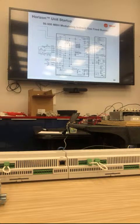Honestly, if you look on the right-hand side, not the contacts or the poles of the relay, but actually the board. If you put a jumper between W1 and W2, that will cause the inducer to come on anytime you have heat 1 on. Another thing I want to mention is that we monitor the gas valve on the modulating side.